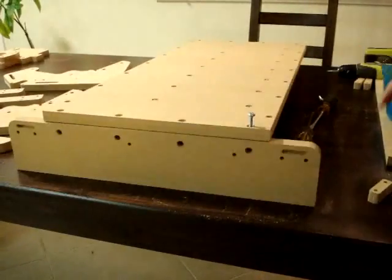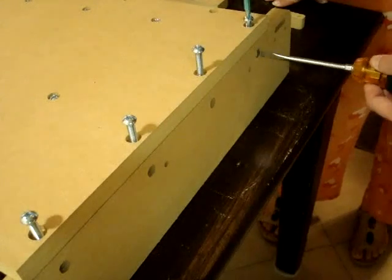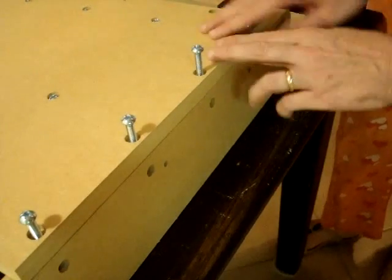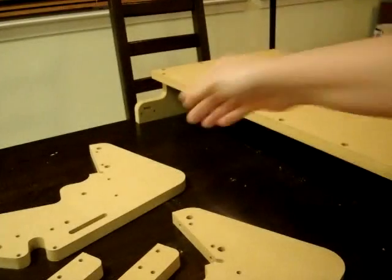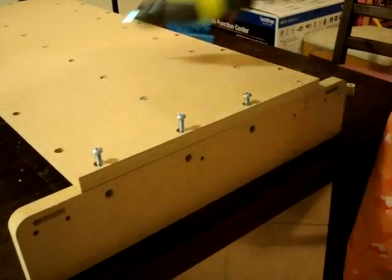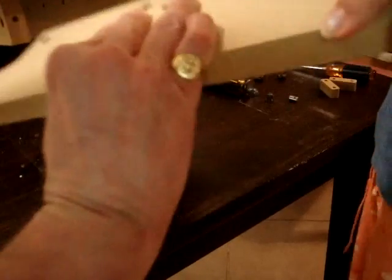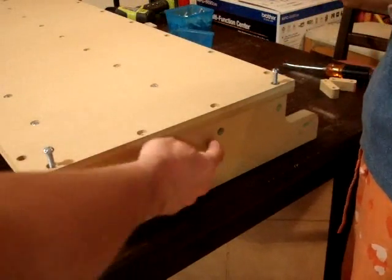So let's go ahead and put these together. When the table is slanted this way and the end is vertical, you want a good right angle to it. Make sure that you have the other table end underneath, so this can be perfectly at a right angle with this side. Otherwise your screws will not align well with the cross dowels. These holes here do not line up with these holes here, so we have to make sure it's turned around and they match. After we put these screws in, we're also going to put the screws at the ends of the supports.